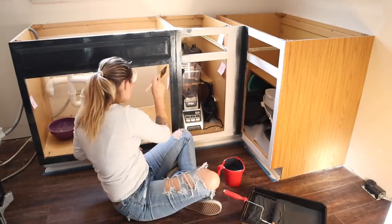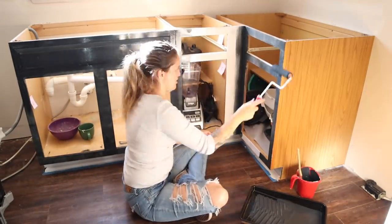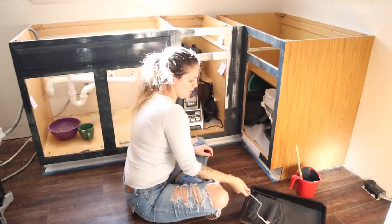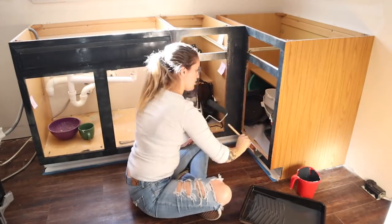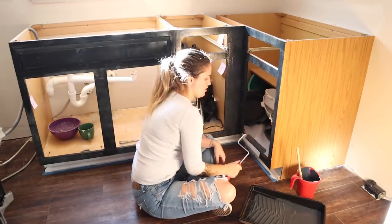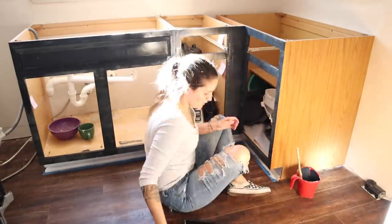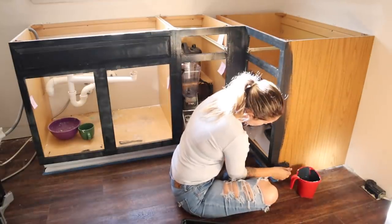Part of getting that beautiful finish was also having a lot of patience and trusting the process, not glopping on the paint and rolling it on thick because I saw the patchiness, but instead trusting that it would layer on top of itself nicely and that everything would work out in the end. So I am going to be painting on very thin coats, and even in doing that, it only took me 2 coats to get everything completely opaque and a smooth, nice, beautiful satin finish.